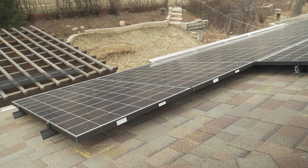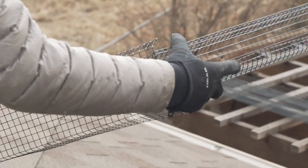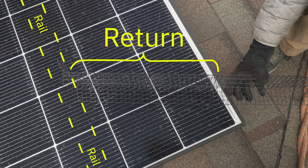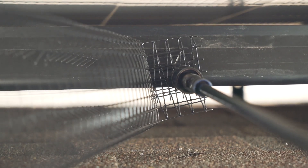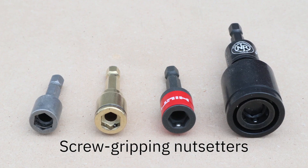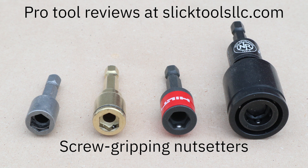If the wire mesh runs more than 8 feet without any rails to attach to, it's time to add a return. To build a return, cut and bend a tab, add a corner, and bend the flanges in to form a tube. The length of the return should be such that it spans diagonally between the rail and the array edge. Push the channel into position, then reach under the array to screw the return into the rail. This takes a little practice. Two things will make it much easier: a bit extension for reaching under the array, and one of the special screw-gripping nut setters recommended on our website. Quality stainless screws are non-magnetic, so they'll fall out of a typical magnetic nut setter.